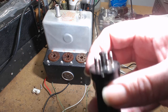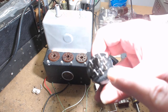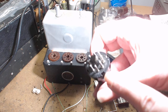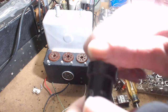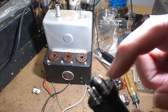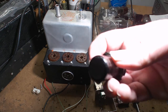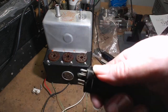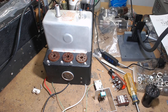But, oh, you can also turn these into a plug. You move these 4 pins apart, these 4 pry marks. It's folded over here. You move them back with a screwdriver. Take your time. Don't put the screwdriver through your hand. You move these back, and then you'll notice this wiggles. You wiggle it back and forth, and the little wires that are soldered in here will break off from the tube. And then you got the tube. The tube is actually inside the metal case. Then you drill a hole in the top, and you put a rubber grommet in there, and then you run your wire out. So this becomes a plug. That's what we used to use in the old days, the olden days, as we would say.